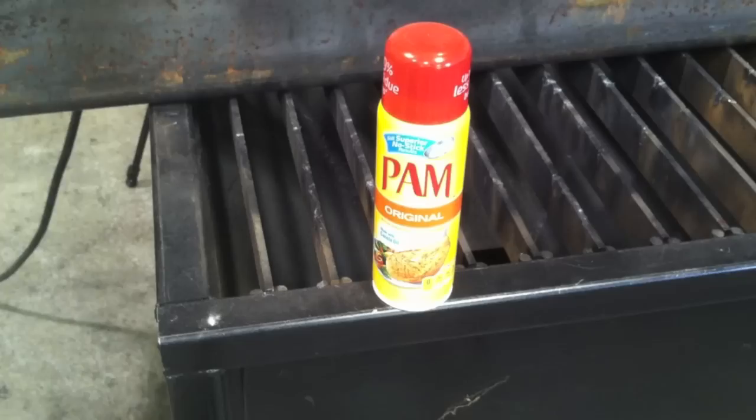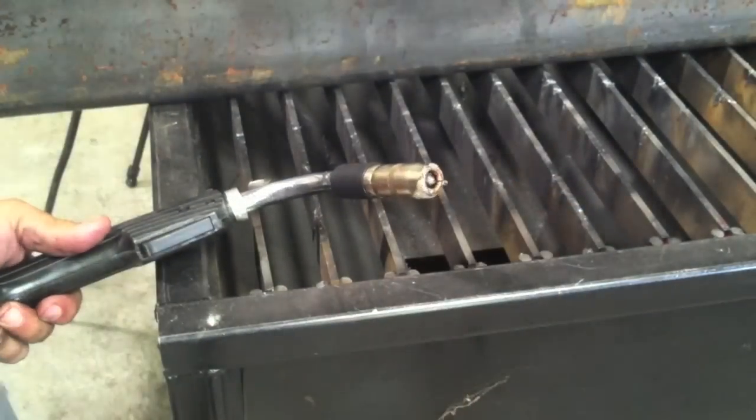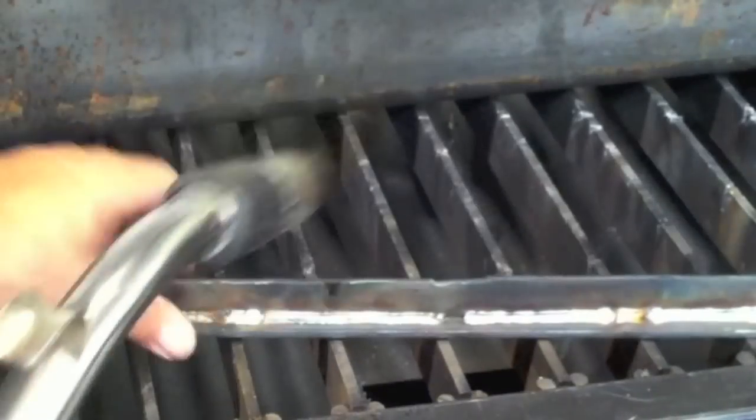It's going to spatter just a little bit more than 75-25 — not crazy, not a lot — but you're going to have more spatter inside the nozzle and more spatter on the workpiece, and if you can knock it off with a big heavy wire brush that's okay. Also, CO2 is more sensitive to wire stick out. Right here I've got a long stick out and it's erratic; I shorten the stick out and it gets much better.